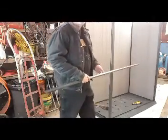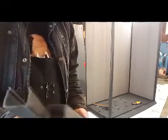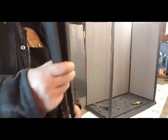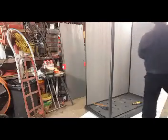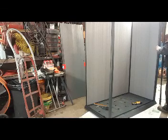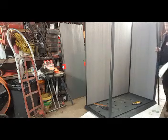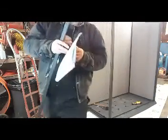Okay, before I go any further, there's these strips. The ends look like this. They're just plastic strips, and they go inside of the panel and a hole on the top. They'll slide down, so that way when you drill the hinges, it has something to bite into. Just an extra layer. And they're later on in the instructions. But since I'm building it inside and I can't go up high, I'm going to put them in earlier.